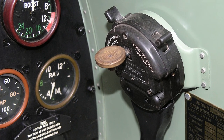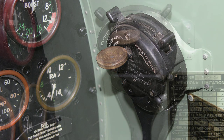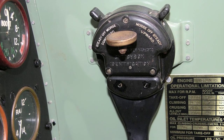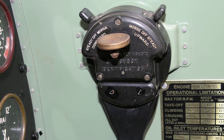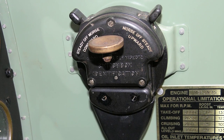This switch box, Type B, has a switch for each lamp on the upper edge and a morse key. The switch box provides for steady illumination or morse signaling from each lamp, or both. The switch lever has three positions: morse, off, and steady.